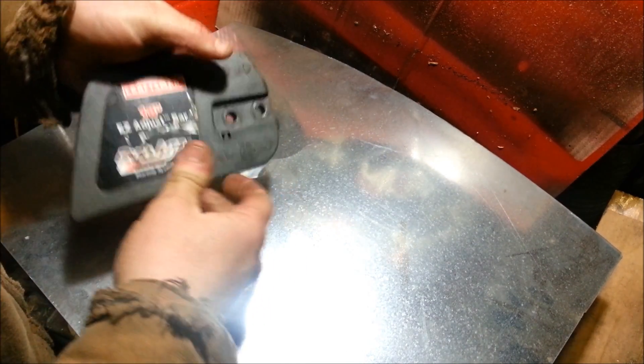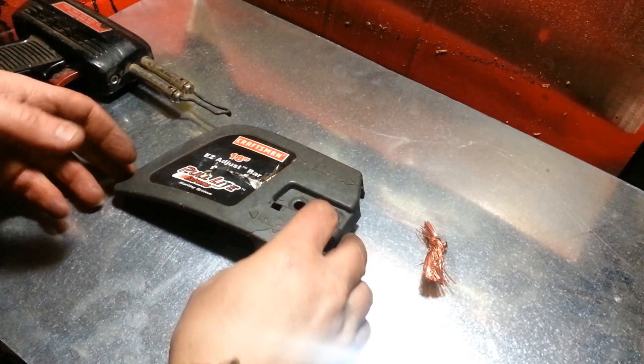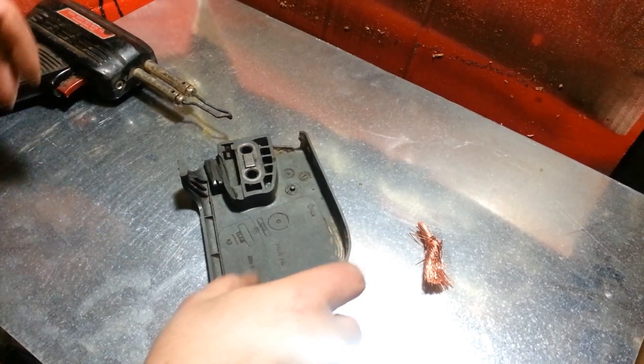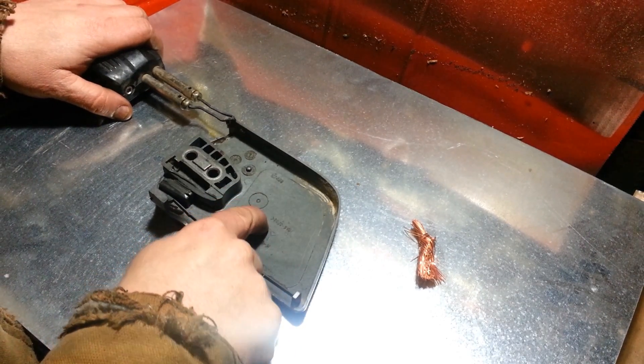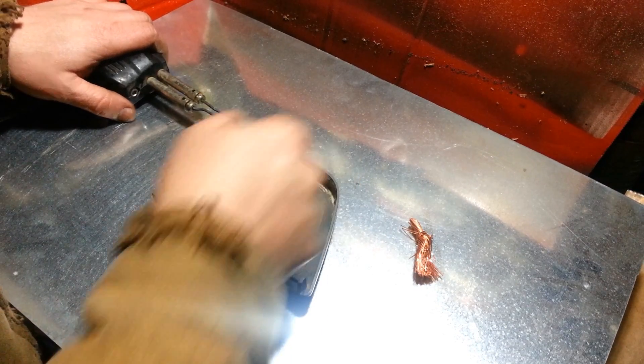If it is greasy, degrease it; if it's not greasy, don't worry about it. This is just a really greasy part. The principle is pretty basic — just using a soldering iron. All we're going to do is wherever our crack is, get down in it, melt 99% of the way through. The further you go through, the better your bond. Get right in the middle of the crack and then fold the edges in.